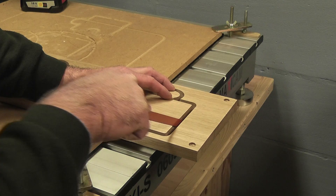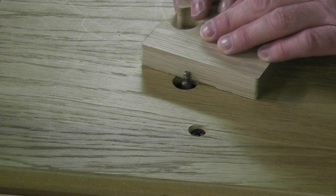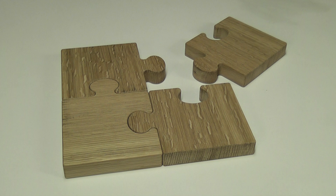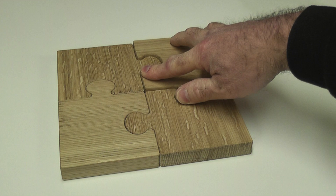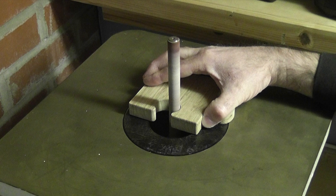Holding tabs prevent the jigsaw pieces being ejected when cut by the router and are removed using a hacksaw blade. What's left of the tabs after cutting are removed by the belt sander. A small round-over router cutter puts a nice smooth edge on the coasters before they are checked for fitting. These coasters are a little tight, so they get a quick pass on the spindle sander ensuring a perfect fit when finished.